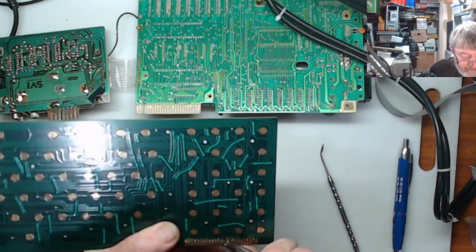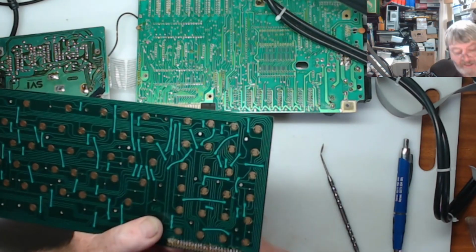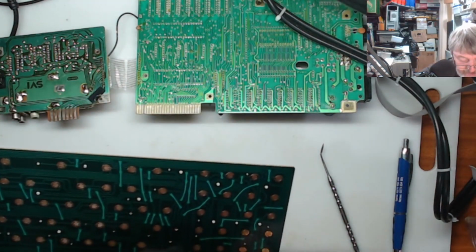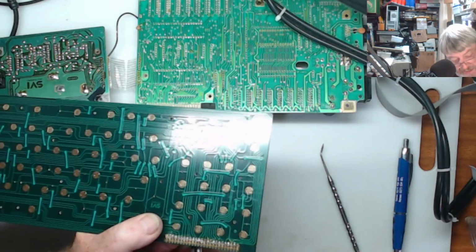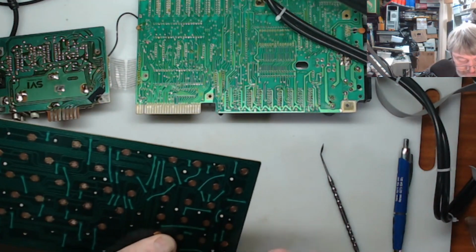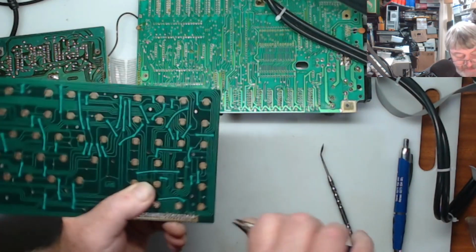Sometimes you find they can be quite tight. The holes mightn't be fully clear, and you get glue in there, and it just makes life so much harder to get the header connector in there to solder it in. So that's one of the things that I find easy.